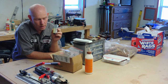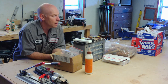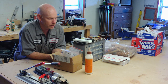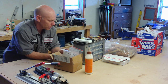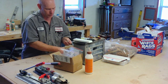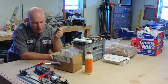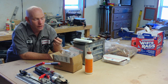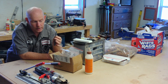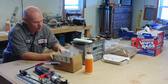For gluing the tube in, get five-minute epoxy resin. Five-minute epoxy is the best — don't use one-minute epoxy; I made that mistake. It sets up way too fast and you don't have enough working time. You also have to buy bushings for whatever drill bit your kit requires. When you're looking online for a kit, check what drill bit it's going to require to drill the brass tube — this one here is my eleven millimeter drill bit, so I had to buy eleven millimeter bushings.